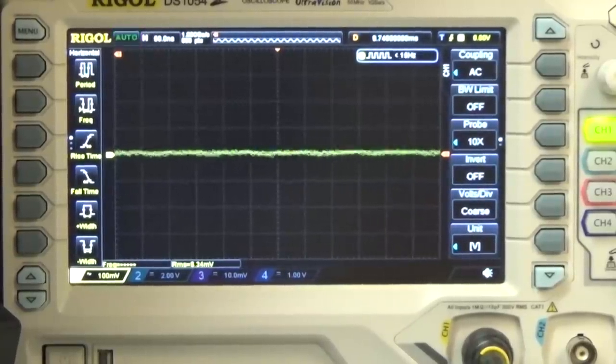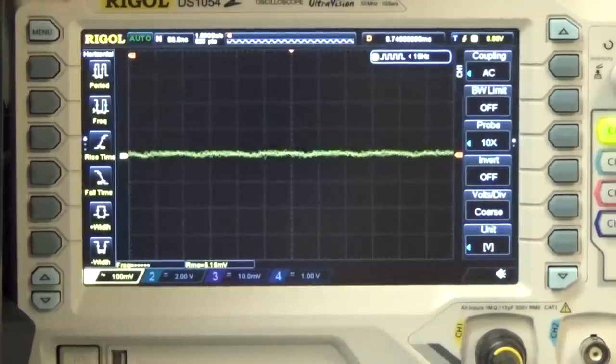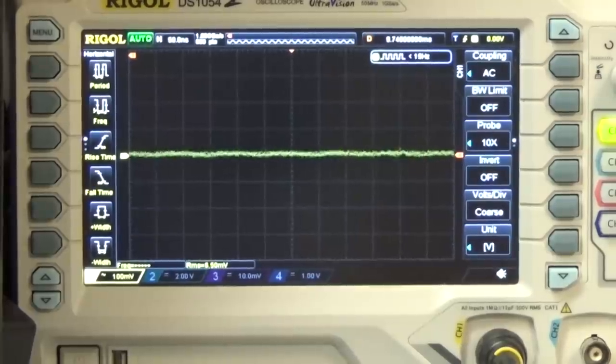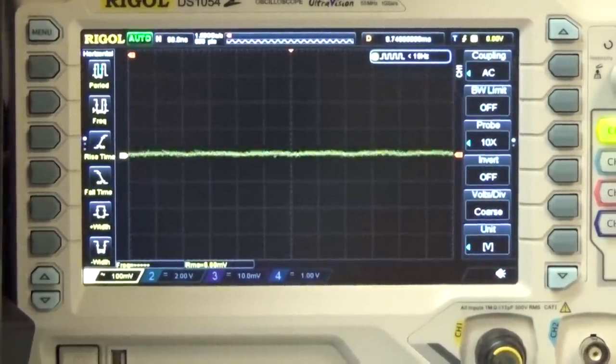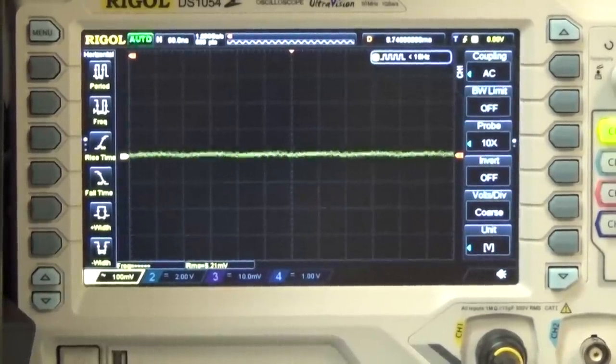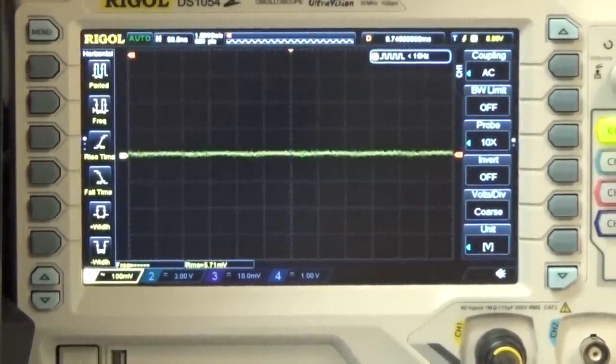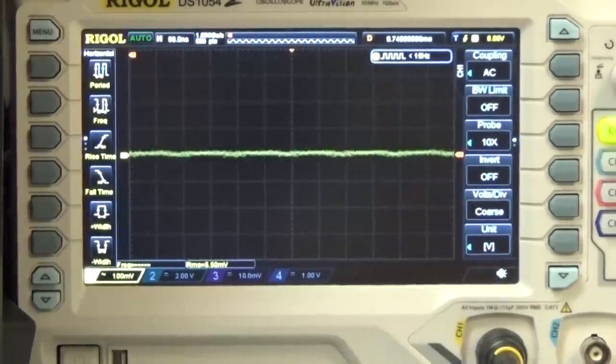And I mean, that could be already an indication or a hint why the radio is completely switching off after a short while, simply because the radio is not getting its reference frequency. And without the reference frequency, there is nothing really working. So the complete PLL circuit, the VCOs and what have we, nothing will work without our reference oscillator. So that is definitely a first fault that we have here in the radio, right?